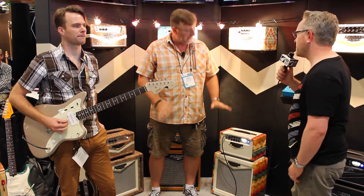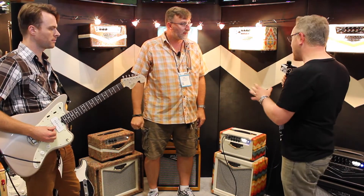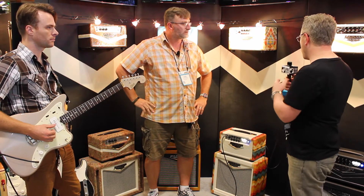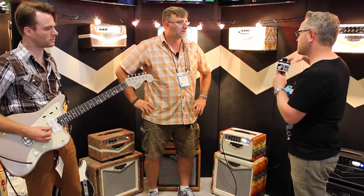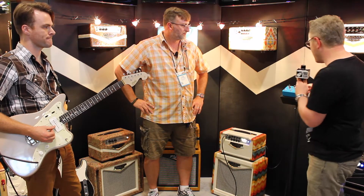Thanks for coming Joel, appreciate you stopping by. Relevant things this year that are new and somewhat exciting for us — last year at Summer NAMM we debuted the Fullerton and the Bakersfield along with what we call the Continuum Controller. It's a tap tempo bias tremolo for your amplifier. It's the first pedal on the market to have digital control of tremolo that actually affects the power tubes of the amp. It doesn't go into the front of the amp — it controls the power tubes of the back end. So it's more of the old school tweed type tremolo.